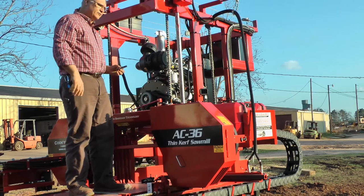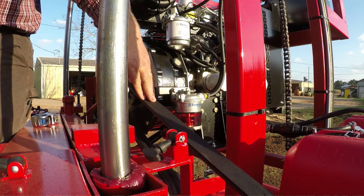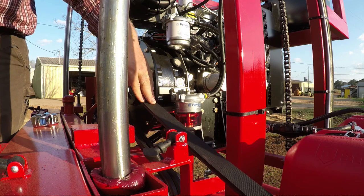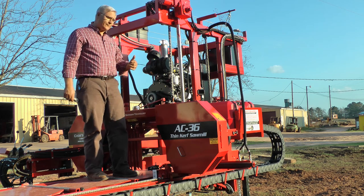About 90 pounds is where that's coming up to, so we would probably put just a little more tension on this long of a belt on our AC 36 mill. We like it a little over 100 — 100 to 110 pounds. If I press it by hand you can see a little bit of movement, but you don't want that thing real floppy at all, and when it's running you don't want it flopping.